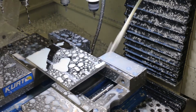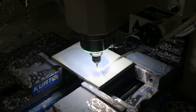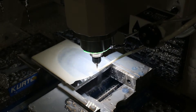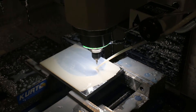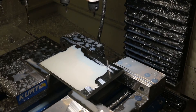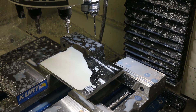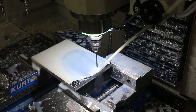Here we're switching to spot drilling, drilling, and then tapping these four holes. You can see the SmartCool has switched to operating with its target position off of Z0. Looking at the code, for these drilling operations it's set at 0.025, which is essentially zero. You can see as it moves down, the tip moves up to compensate.